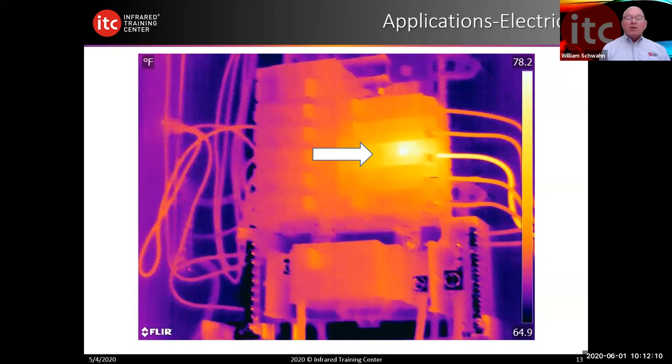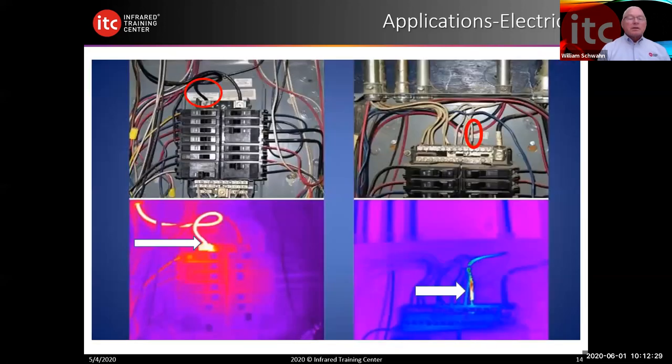We're providing more data; we're not here to make a determination. We need to follow our standards of practice — it's important that we provide data that lends towards a better evaluation rather than actually providing a resolution. Here's another electrical image with some arrows drawn. The thing about infrared is it shows something you would not see visually. You can see that these conductors are overheated. On the left side, a conductor at the top is overheated; on the right, a neutral conductor coming into a panel is also overheated but you can't see it visually.